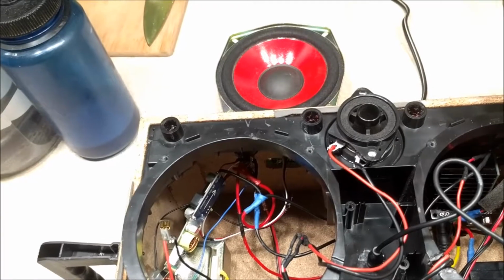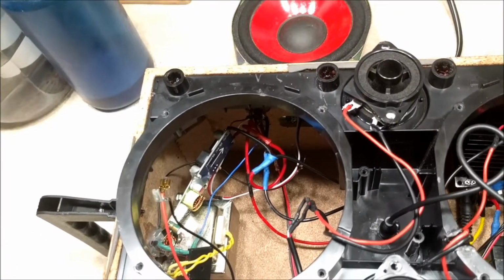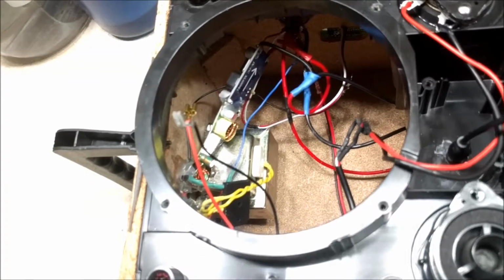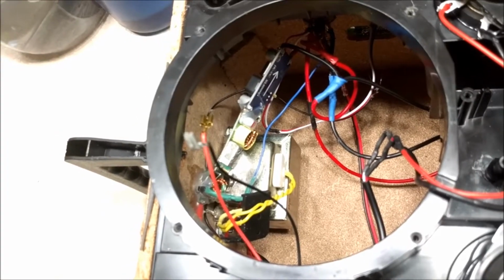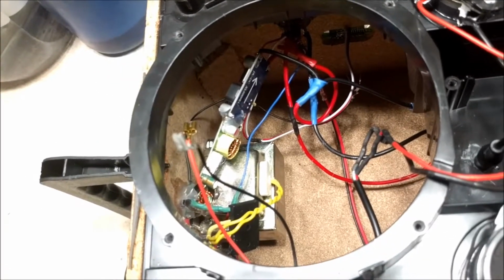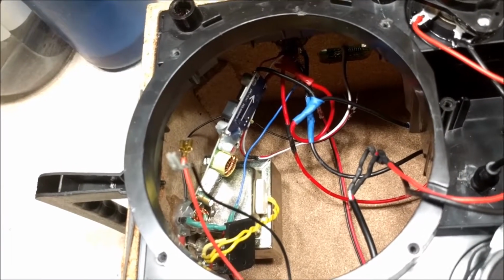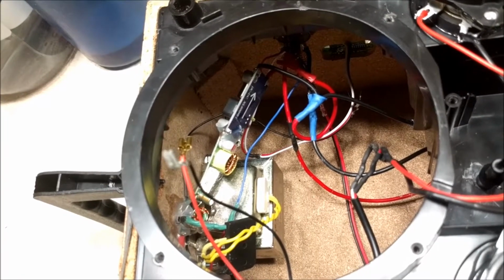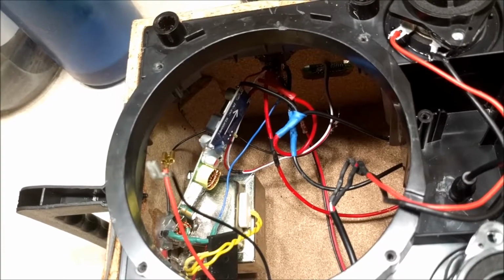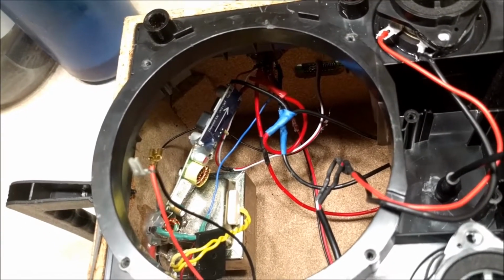So yeah, and then you'll notice I've got this pretty rigged up setup here. 120 volts AC from the wall becomes 14 volts AC through that transformer. Now, I've measured it as high as 15 volts and as low as 11 volts straight out of the transformer. So in order to mitigate that variability, and it's also AC, even though the transformer says DC,